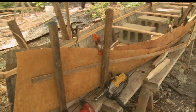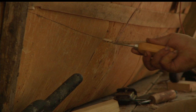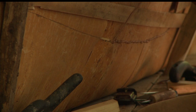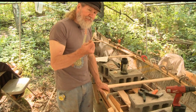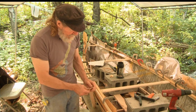I'll never look at a canoe the same way. I've always appreciated them, but to be involved in all of the steps — wow, there is so much work involved in one of these. We're just sewing the extra sheet of birch bark to get the height off of this one. We finished off the far side, and this one needs a single stitch that runs down the length of it — it's a double lacing, so as one goes out, another one goes in. This morning we carved the outside gunnel piece, having previously done the inside gunnel piece. Now one thing we do is we peg through the gunnels — it helps give additional strength against shifting up and down and locks the bark in place. So we drill a hole.